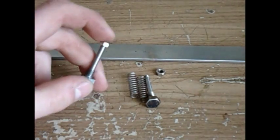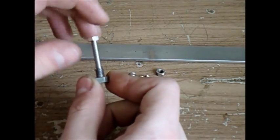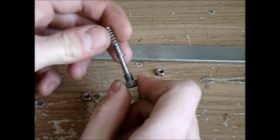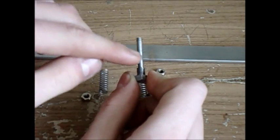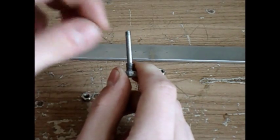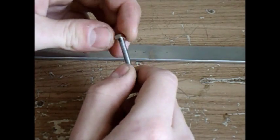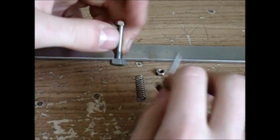These are the bolts that I turned down. They are regular M6 by 30mm length bolts. I didn't have any big enough springs, and I also didn't want to risk these binding on the threads, so I turned these down smoothly to 4mm. Then on the very end I turned a small portion of M4 thread to act as a keeper so not everything is jumping out, and I made two of these.